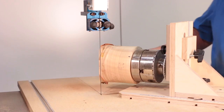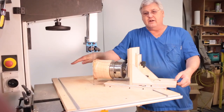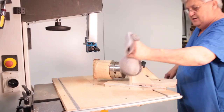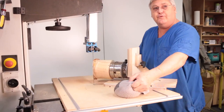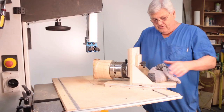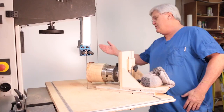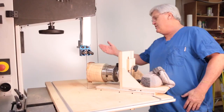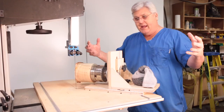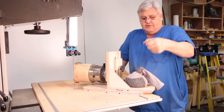Here's a problem a lot of people may have: let's say this extends out further — a big heavy item that's out of balance. What I do is take an old sock and put lead ballast in it — lead shot, go to the hardware store and get it. It actually works really well to counterbalance something. When you do jig work on any machine, sometimes you have to support the table that's sliding, support outfeed or inboard, or counterbalance something. It's just the way it is — otherwise you'd have to build a huge heavy jig. Don't be afraid to use even rocks or sand. Anyway, there's a tip, and that's for the index.